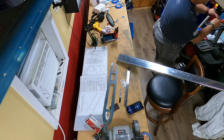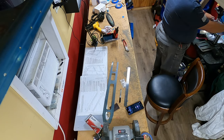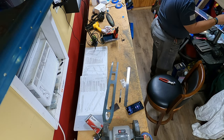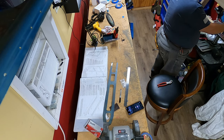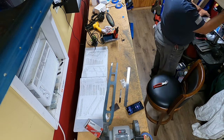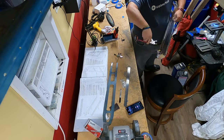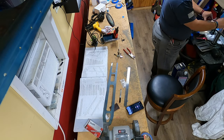Here you'll see me selecting a proper drill bit. It says to use a 3/16 inch drill bit on the web. You can get away with using a regular drill bit that's probably made for wood, that you'd pick up at your local big box home improvement store. That's what these are. However, for the large part, for drilling on aluminum, especially aircraft aluminum, you'd probably want to invest in some carbide tip drill bits, because that is what I have for the number 30 and number 40, and a few other numbers already, that I purchased from Cleveland Aircraft Tool as part of their RV-10 Builders Kit recommended tool list.